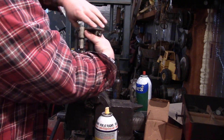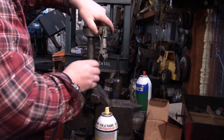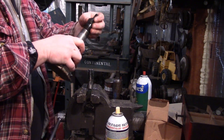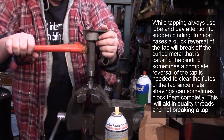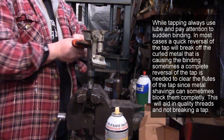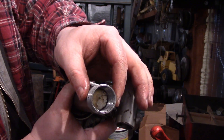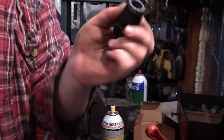We'll see how deep I got here and test out the thread. With a pipe tap, you're not tapping it all the way — it's a tapered thread. I don't get very much bite in this, so I'm actually going to thread it a bit further. I'm not happy with that. I felt some binding there — we're going back and forth because it's catching pretty hard. Looking at some nice clean threads so far, sitting about that deep in. I believe that's going to be tight enough for what we're doing.